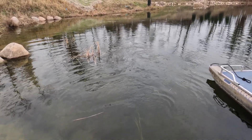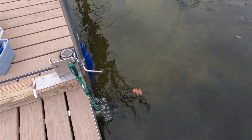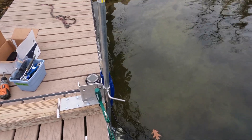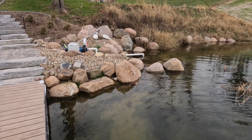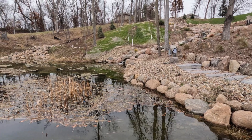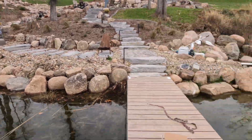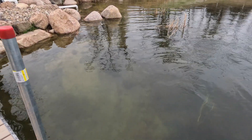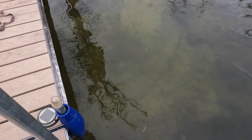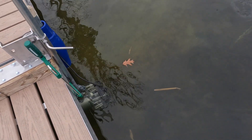The current easily reaches 40 feet out there. This has multiple purposes — we're going to use it this winter to keep some open water right here around the dock so the dock posts don't freeze and get damaged, and also to keep our intake bay open and free of ice because we're going to leave the waterfall running this winter. Go ahead and like and subscribe to the channel so you can see our progress. In the summertime, if you want to clear a shallow area free of vegetation, this thing puts out enough force to blow vegetation right away.